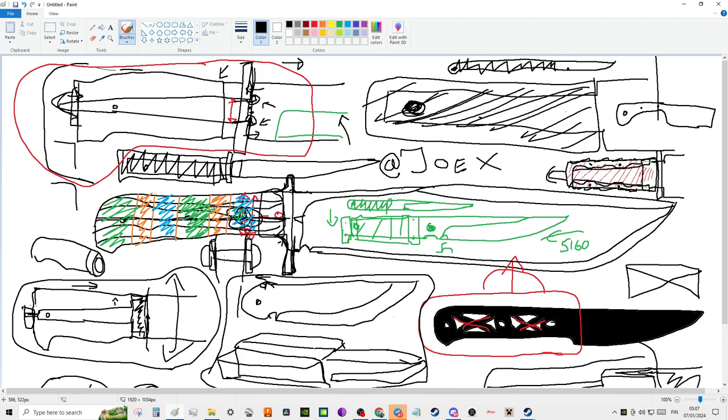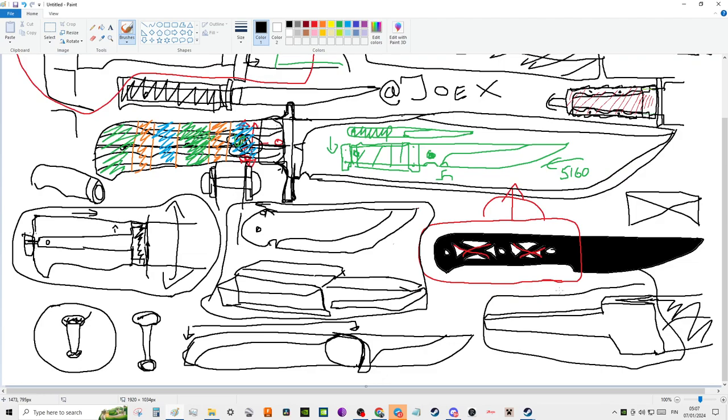And if you look at a lot of old tools, that's how they're done. That's how it's been done for a long, long time. Before we had screws and folding knives, we had peens. So, yeah, there actually is a weakest one of all these constructions, and I think it's actually weaker than a skeletonized full tang, and that's these threaded tangs. They are pretty difficult to get right.